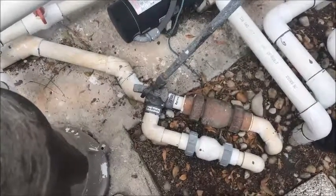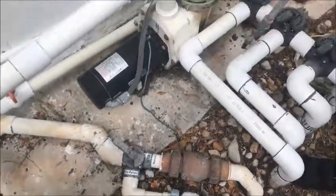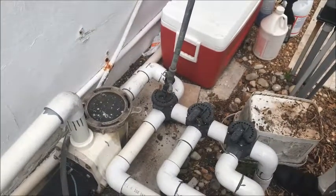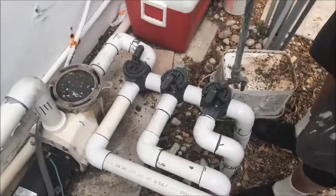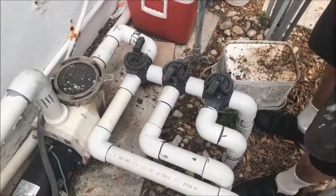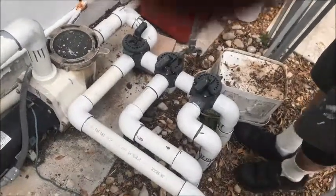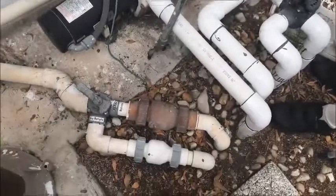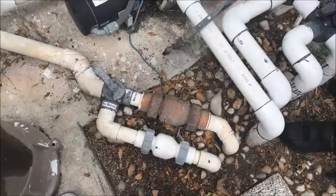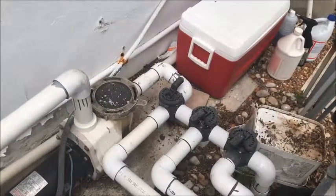Which is what you want to do when you're just heating it. To close it, I'm going halfway — that'll distribute it halfway. I'm going to shut this one off completely. The water is being sucked out of the pool with these two: one's for the bottom drain and one's for the top suction. This here distributes either half the water fed into the pool and half into the spa — that's why you have a waterfall. If you shut this thing off completely like I did, there's going to be an overage of water coming into the spa, and that's where you get the waterfall.